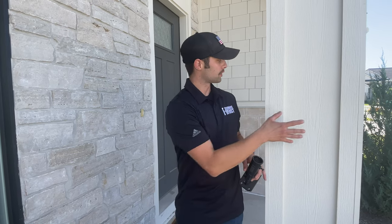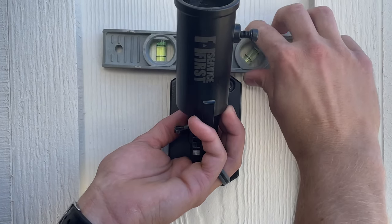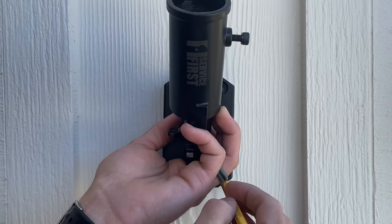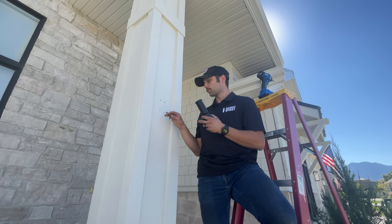For our install today we've chosen the front pillar of this home — it's a flat hardy board surface which will make for a pretty easy install. However, if you are going to install to any masonry, uneven surfaces, or concrete, we recommend seeking advice from a local home improvement professional on how to anchor it properly. We're going to place our mount, find the most central position we can, and use a leveler to ensure we are level. Now we'll mark off our holes, begin drilling, and use the hardware included in the kit to install our wall mount.